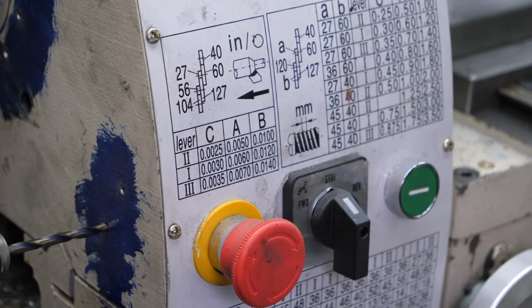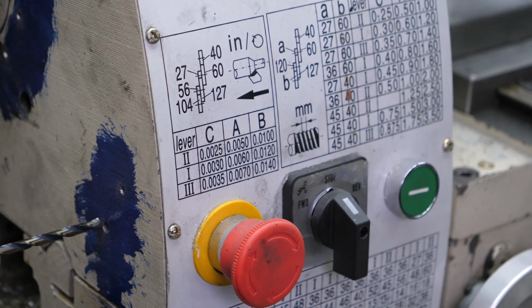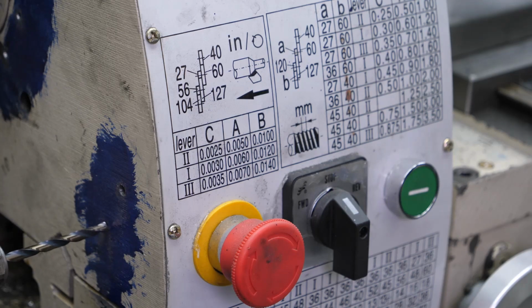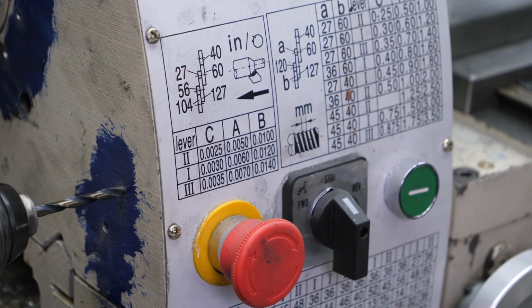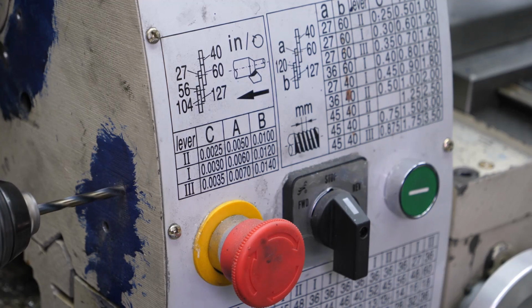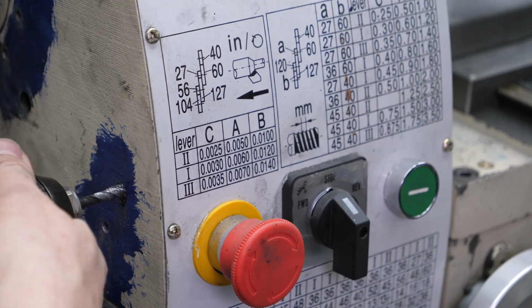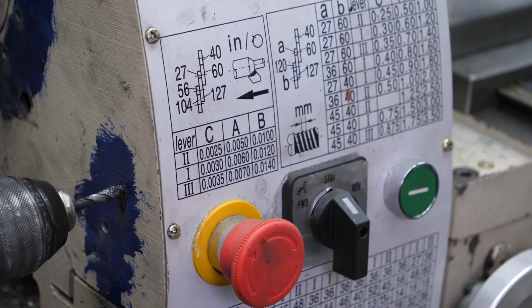The 4 pilot holes get drilled out with a number 12 bit, which is the correct drill size for an M6 tap. I'm drilling carefully here because I don't want to break through abruptly and possibly damage the emergency stop switch. Next, the 4 holes are tapped with an M6 tap. I'm using a spiral tap, which is my preference because oftentimes you can power tap with them.